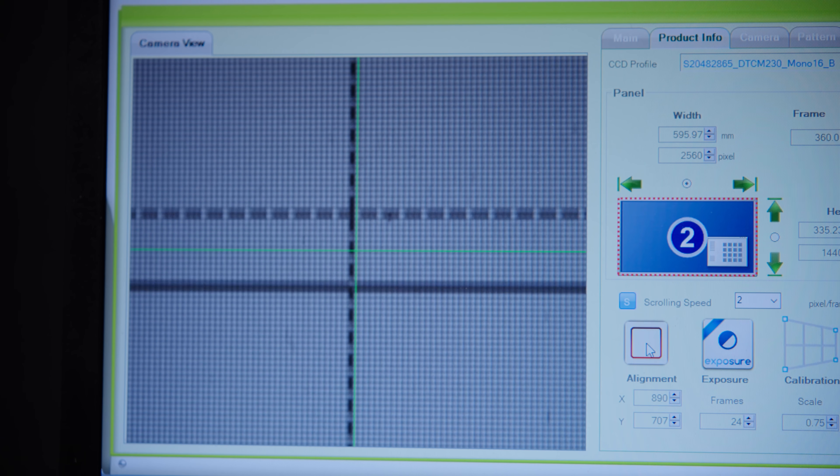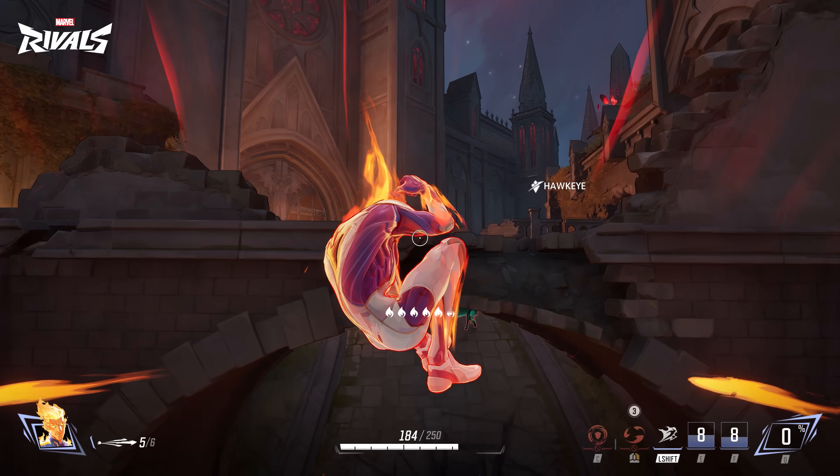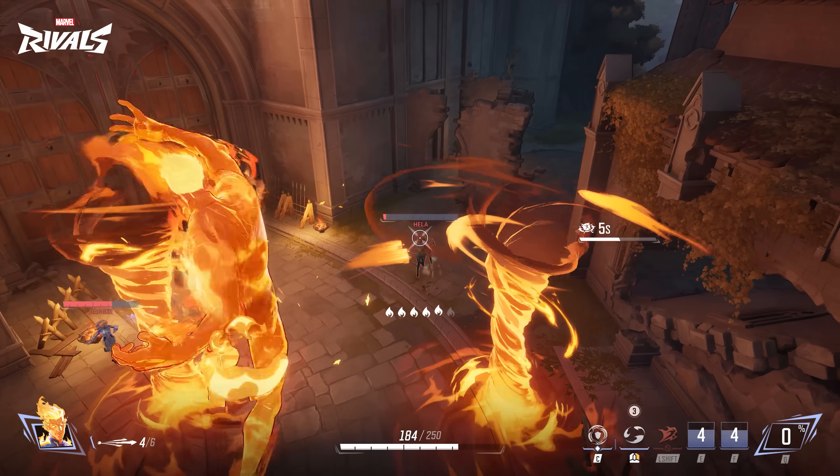We tried for over 10 years to develop pulse sequences that would not flicker. At one point we even proved that the solution wasn't possible — we almost gave up there. Until a colleague suggested adding a compensation pulse, shifting the flicker to a higher frequency where it's not visible. This breakthrough enables G-SYNC Pulsar to improve motion clarity, together with VRR, without any flickering.